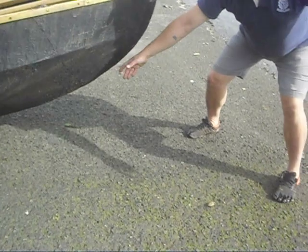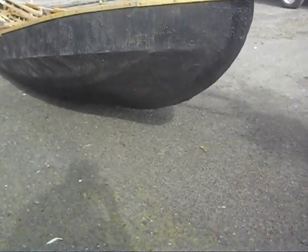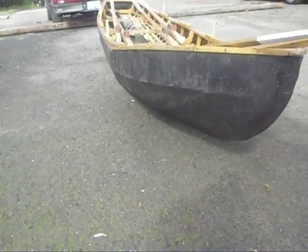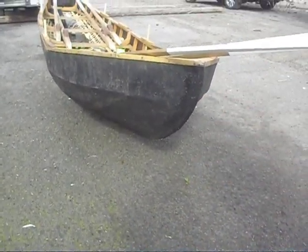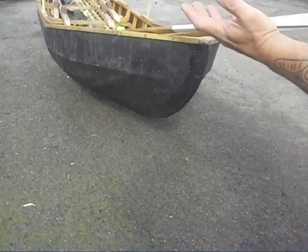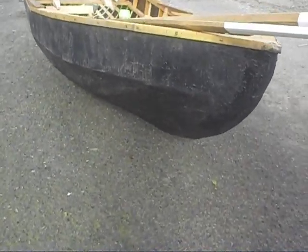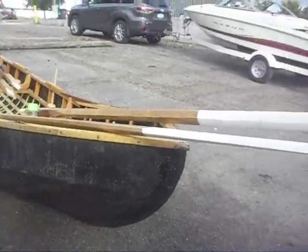Also, if we come around here, it's resulted in a hollow bow. If you look further back, you can probably get the best angle — you can see we have quite a concave bow here, rather than the more full, convex surface of a regular Kerry Currach. Now this hollow forefoot means that when we meet a wave, the wave's force is diverted by that curve, so we get dynamic lift and not just mere buoyancy. We're using the wave's energy to bring the boat up, and in my opinion it makes for a more seaworthy design.